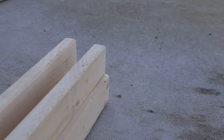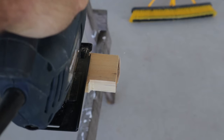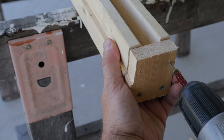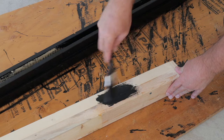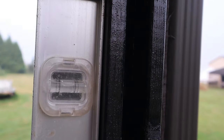With all clamps removed, this is the eventual shape of the rail. I use a scrap piece of 1x3 and trace it out so I can match the shape of the bottom end of the rail. Once I cut that down to match the shape, I apply it with screws to the bottom end of the channel. It's not too pretty but it won't be too visible once it's all put up. Finally, before installing the rails, I put a coat of black paint on them to make them a little prettier, then head to the back deck to install the fully assembled black rail onto the post of the house, making sure it's completely level vertically.